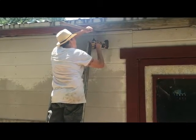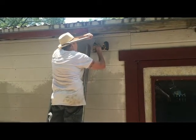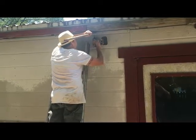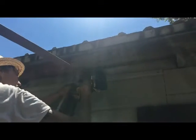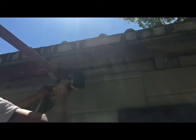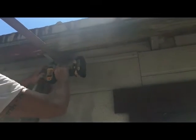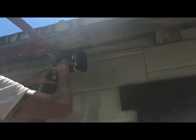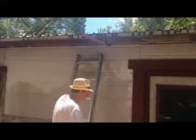I'm screwing it into the bottom — yeah, there's a stud there. I'm not even screwing these in all the way because I don't want them all the way. What that's going to do is hold the end of that guttering so I can crawl up on the other side and put in one screw.